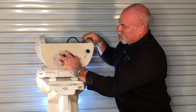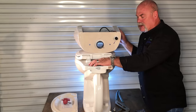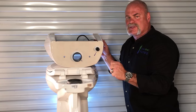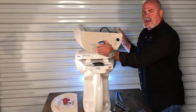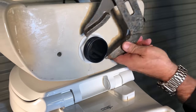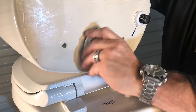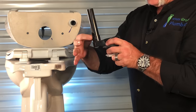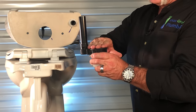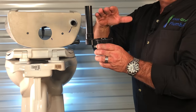Now this is the bottom — this is the gasket. This gasket normally comes off pretty easy. Sometimes if the tank is very old, it will stick to it and you may have to pry it off. You will want to change this gasket out because you do not want to leak here. If you have a leak here, every time you flush the toilet, water is either going to come down around the edge or run down behind it, and this could cause damage to your floor. As you can see, we have a very large plastic nut on the bottom of this flush valve, so I've got my large channel locks. Once you get it loose, you may be able to undo it by hand. This is actually the flush valve — this is the part we're changing out. This is the round smooth surface where the flapper sits and clips on these arms. So every time you flush your toilet, it pulls up the flapper, lets water go down into the bowl, and then after the water level comes down, it goes down and seals off again.